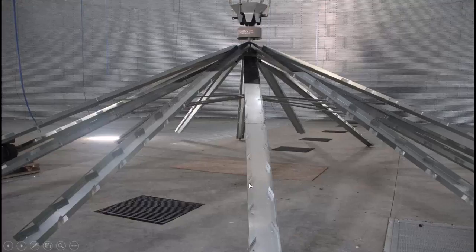If you don't see those lines or have problems getting them back, we do have some measurements that we can provide from the factory to get those back to factory settings. But it's important to check out these tabs when you're up there to make sure everything's cleaned out, there's no cobs, stalks, anything stuck in there that would cause an obstruction and reduce the performance of your spreader.